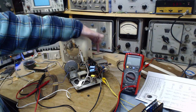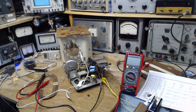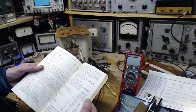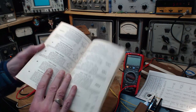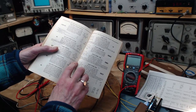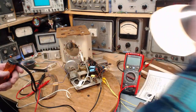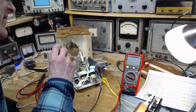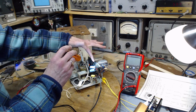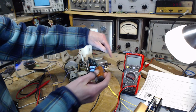We've got high voltage on two of the tubes. Never measured the 50. Let's measure the 50C5, find out what kind of filament voltage it's got. Now it should be just 50 volts, but I suspect... This is the 50C5 here. So if we want to look at the heaters, 3 and 4. Can we find 3 and 4? Very easily. 4 is this white wire that's coming right up to the power line. Right to there.